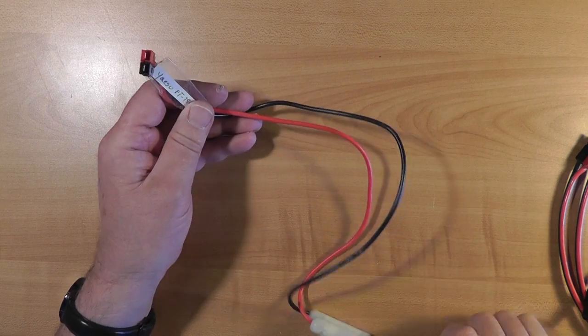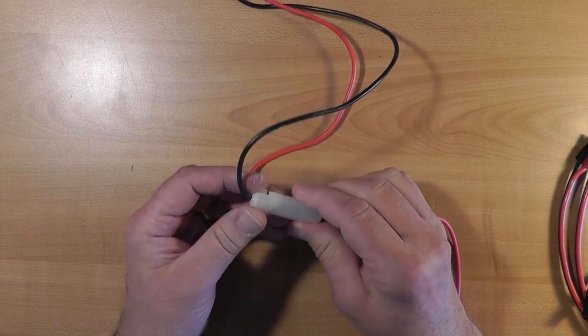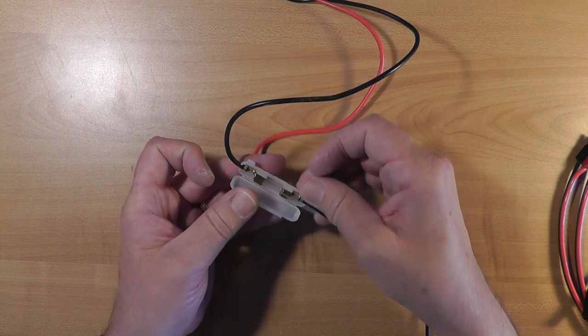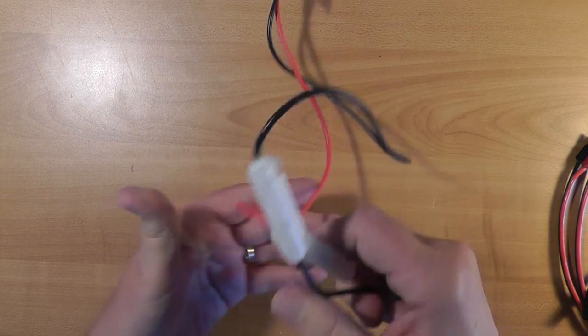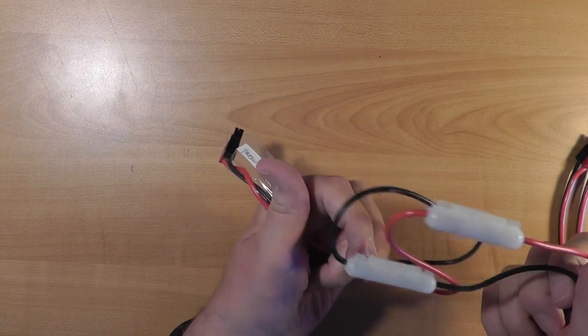For mobile rigs, often you'll find an inline fuse in each lead. Don't defeat these. Go ahead and leave them in. Yes, I know that the manufacturers put these near the end of the line, which makes for a long power cord, but still let's keep every margin of safety we can.